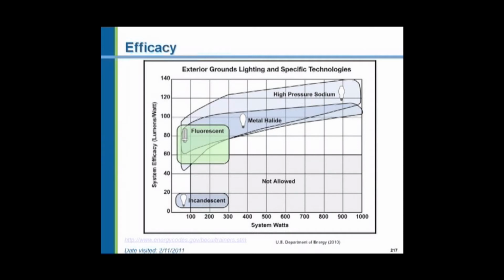And federal legislation is now eliminating incandescent lamps. In 2012, the 150 and 200 watt incandescent lamps will be going away. 2013, the 100 watt lamps will be going away. 2014, the 40s and the 60s. There will be incandescent lamps left for special application. Remember the heat lamps I told you over food serving cafeteria lines. Oven lights. In ovens, they operate at high temperatures. There's nothing else that can withstand those high temperatures but a high temperature incandescent light. Refrigerator lights, they're on so seldom.